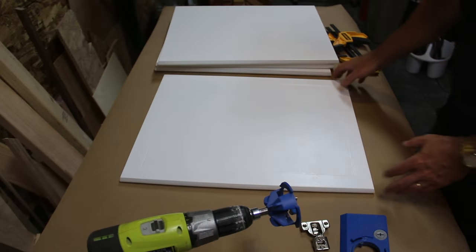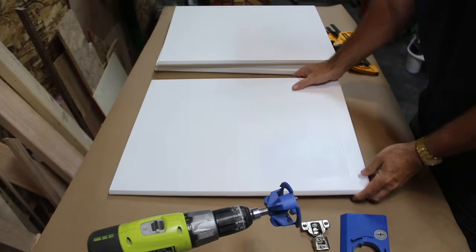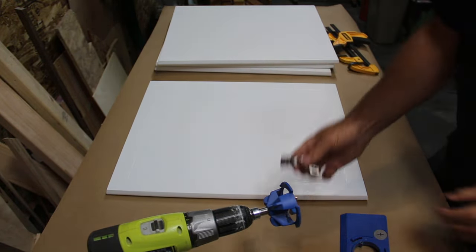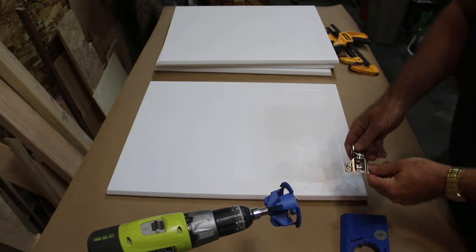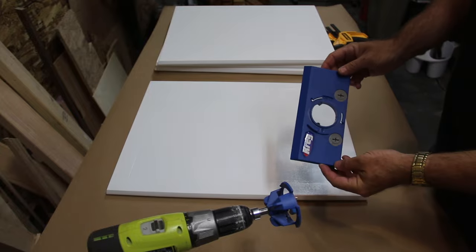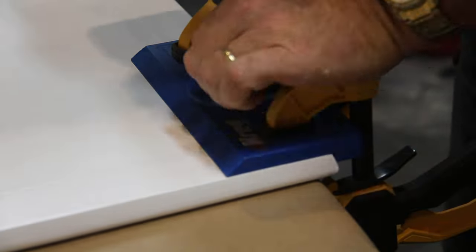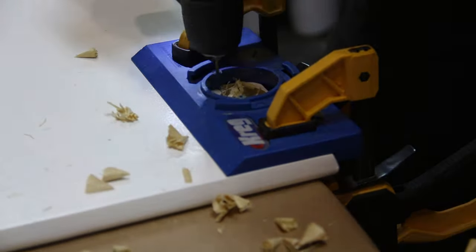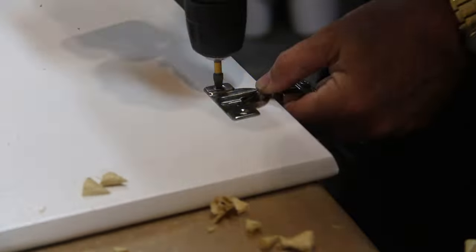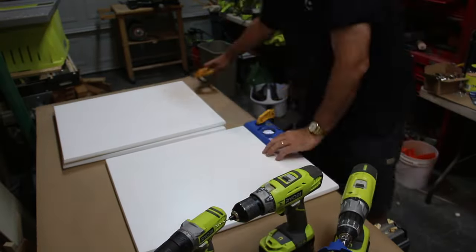So Mama Yourself did a really great job painting these doors front and back. Now it's time to put in the European style hinges. I got these hinges right here from Amazon. I'll put a link to them in the description. And I'm using this Kreg jig with the 35 millimeter hole bit and the adapter so you don't go too deep. And really, these doors are all symmetrical, so as long as I get them on the same side, all the doors will fit no matter where I put them in.